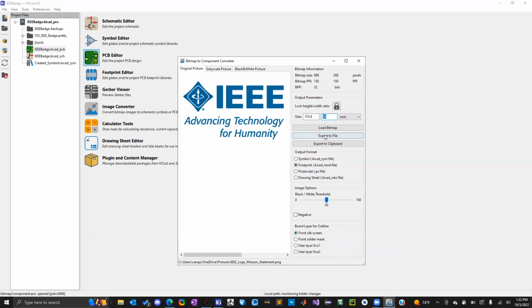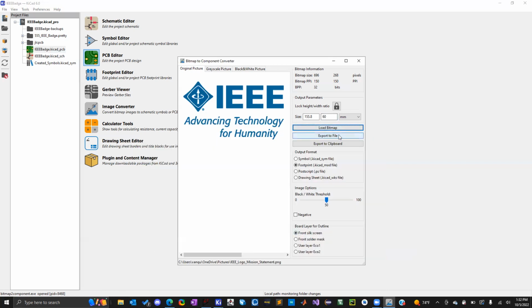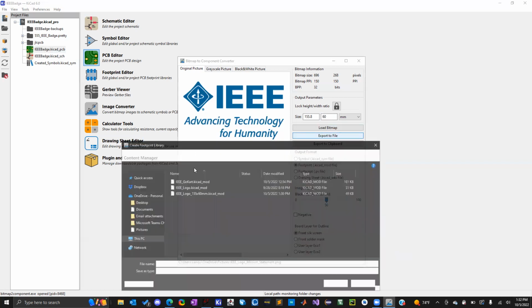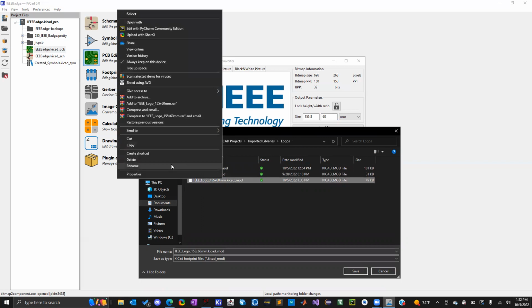So, after you've loaded your image, so you selected that, and then you selected the image, you're going to click on export to file. And then it'll ask you where you want to save it. I didn't do it to the first one, but I recommend adding the size of that logo, because it'll help you when you're in KiCAD and picking out the logo. So in this case, I call it IEEE logo. It's about 155 by 60 millimeters. Maybe I should change it to...